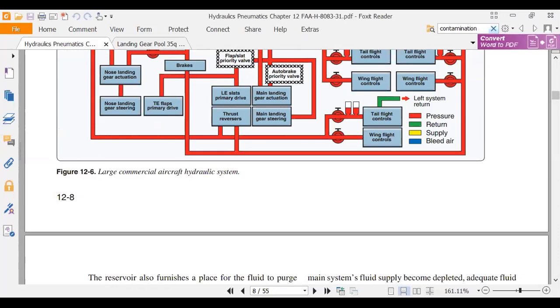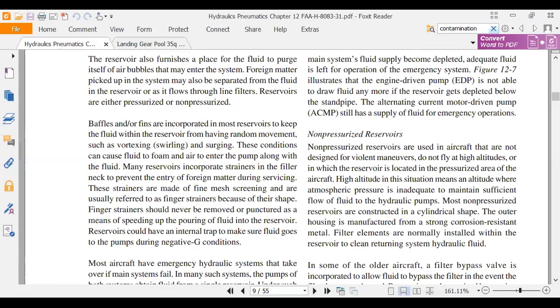Remember what a RAT is? R-A-T? Ram air turbine. Exactly. That's your, oh Jesus, save me, I'm about to die moment. We've lost both engines. We've lost our utility or electrical system, and we've got nothing to fly the airplane. The airplane's dark. You pull the lever, out pops this little propeller and spins up a hydraulic system that'll run just enough hydraulics to keep you alive.